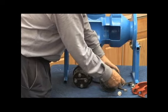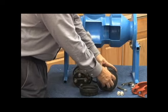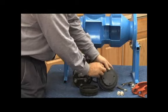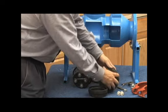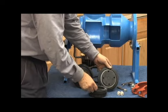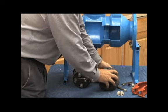Check springs are not replaceable in the field, meaning that if you have to replace check springs, you're going to replace the entire module. All you do is take the check disc off, new check disc like that, and rebuilding is just a matter of changing that flat disc. Check spring, as I say, stays contained for the average repair and does not have to be replaced. Reassembling, as I say, just the reverse.